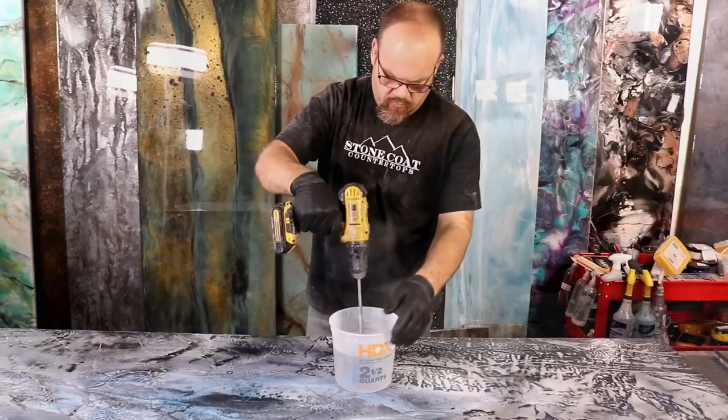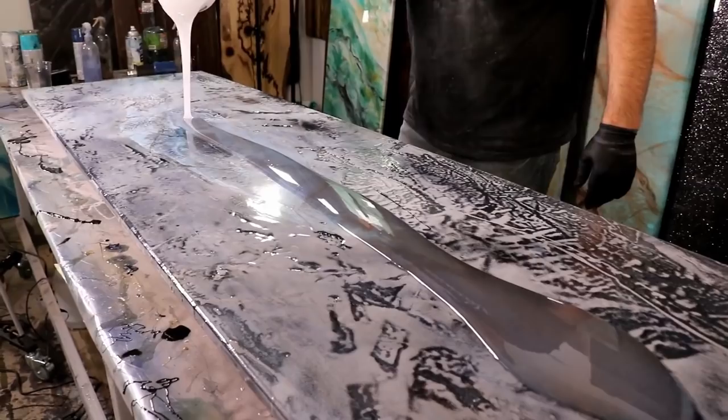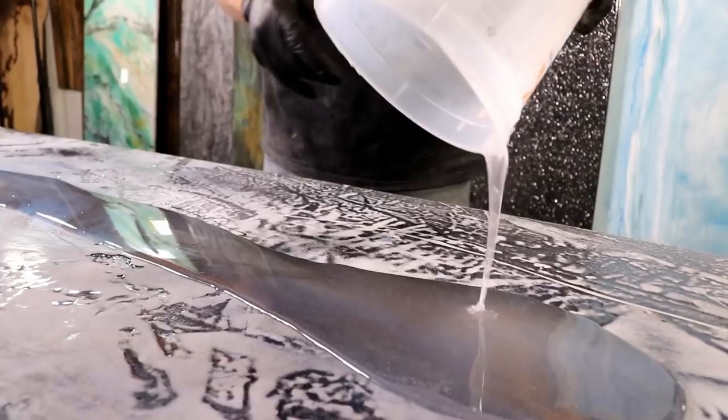Again, on this coat, we're going to use 3 ounces per square foot. It's a 1-to-1 ratio. We'll use a drill to mix that up, and we'll apply this using our square notch trowel. Then we'll chop that, we'll torch it, and we're ready to spritz our ocean blue and skip trowel that across the surface.